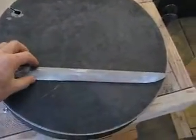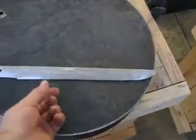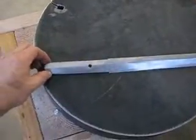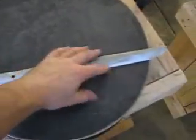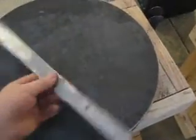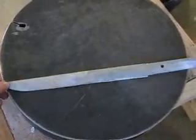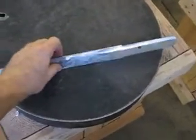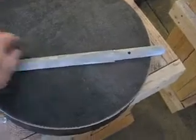The blade starts a little wide here, it narrows a little bit there, so it tapers. It also tapers just a little bit in thickness. Now the tang — I didn't do so great with that. It's probably acceptable. It ever so slightly curves because I plan on this curving during the quench. It's okay, it's not bad. I don't intend for it to be anything special, but just to practice claying and quenching — we're going to actually clay this blade up and quench it as well, just for the fun of practicing.